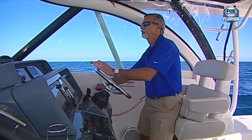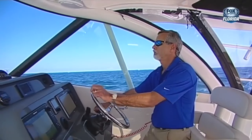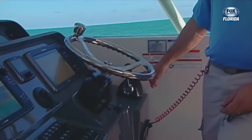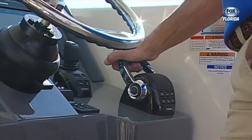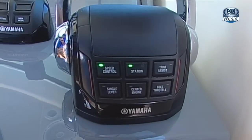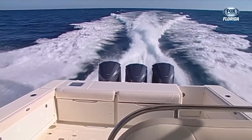If you're in rough water and you want to stiffen the steering yourself, you can do that through the gauge. The actual control box is one of the hearts of the system - it's basically a twin handle even though there are three engines in the back. It has three buttons up front for individual trim, a master trim on the side, and six really nice features that set Helm Master apart. One is speed control, which is like cruise control on your car. Another is trim assist, which automatically trims the motors in and out depending on the RPM where you have the throttle set.